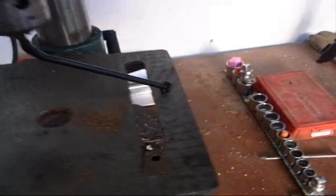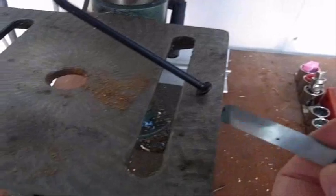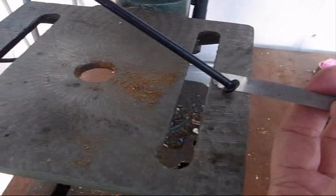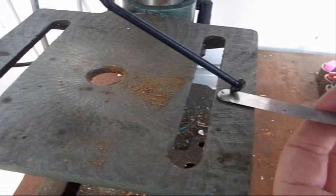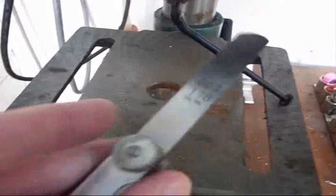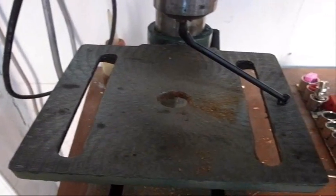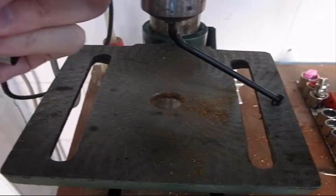Then on the other side — make sure you get in there square. This table is not exactly square front to back. I've got about 0.178mm on both sides. This is still very square from when I made the last video.